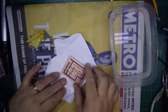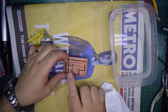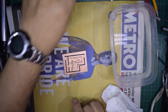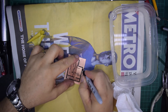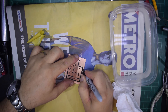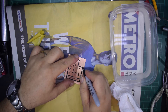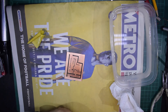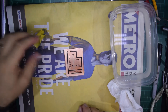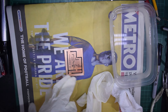Let's dry that off and have a look — that's come out fairly well actually, quite a nice print. The fine detail is all there; this wider track seems to have suffered a little bit, so I'm just going to get a regular Sharpie and colour that in. Obviously if you've got a lot of missing pieces it would actually be easier to strip the board and start again — just sand it off and reprint. But for this it doesn't seem worth it, so the board is ready.